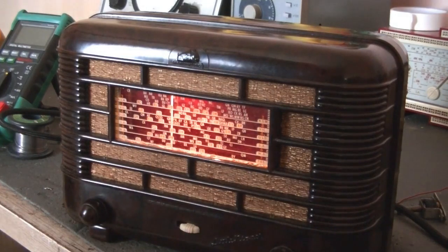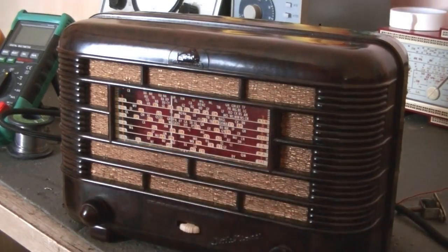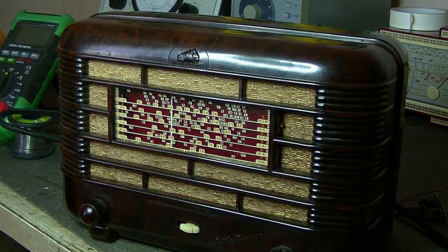As I said, the volume control is not entirely quiet, but I've had lots of radios like that, and I don't have that particular volume pot to replace. It's got an extra lug down the bottom, probably a tap at 30k or something, who knows. But look, it works fine. Great little radio. A real classic example of bad sound coming out of just bad capacitors. Work your way through it, and it came up a treat.